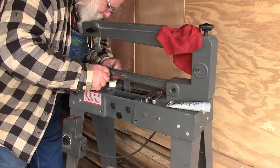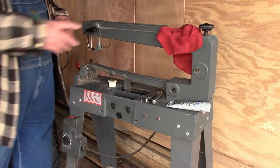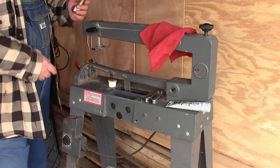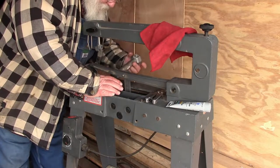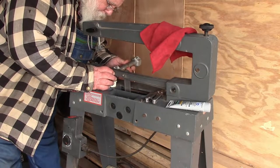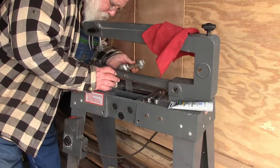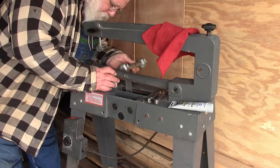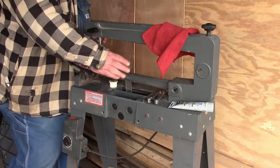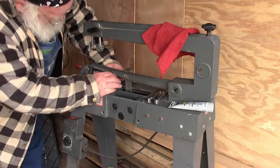Okay, we're good on that. Now I'm going to start the pin back in — believe it or not it's just about there. I'll clean up my fingers here and we'll use this funny hammer with just light taps. There she's moving. Also, notice I'm supporting the arm while doing this so that a heavier tap isn't going to cause that arm to snap. Everything looks absolutely good there.